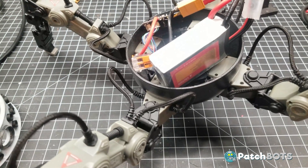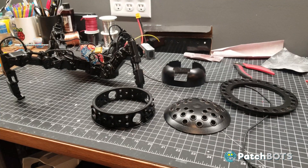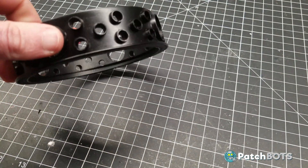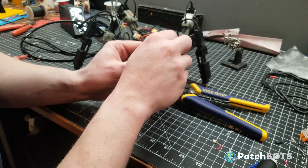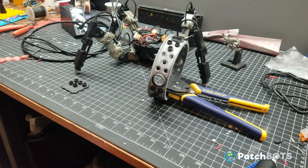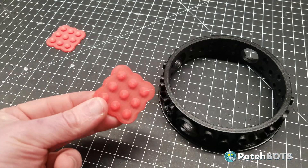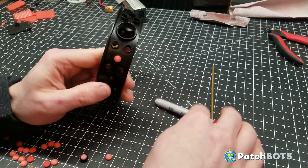The next step is getting all these parts painted black and then doing the final assembly. The painting was super straightforward — just black spray paint on all of the 3D printed parts and each of the individual legs. I'll probably weather them later, but for now we can move on to the assembly. The first thing we're going to do is address all these little holes in the main piece. These are actually 32 little lens holders. Before I painted the main piece I glued each of the 32 lens holders into place, and now we're going to finish that section by inserting the lenses. Matt Hobbs used resin printed lenses, but I'm currently without a resin printer so I printed FDM-style press-fit lenses — I'll make those files available on my GitHub. Then it was just a matter of pressing them into place.